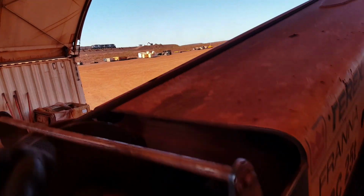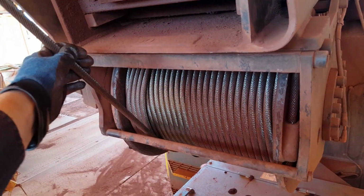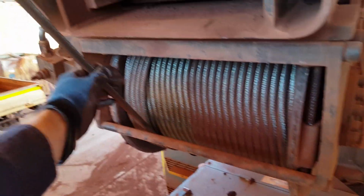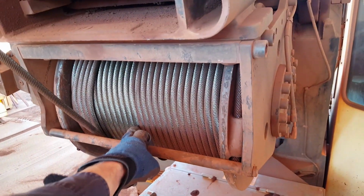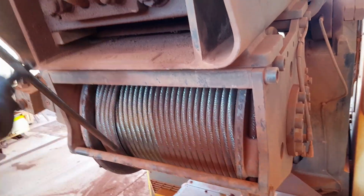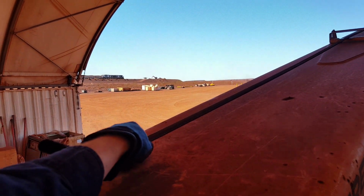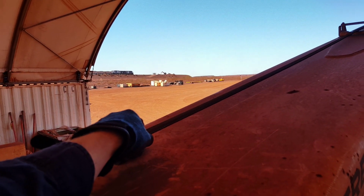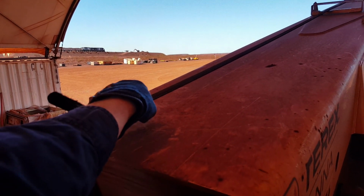There's no weight in here. There's no weight here. And if you're flying on the winch, going up and down really fast, this has got no chance to reeve up because it relies a lot on weight being pulled on it to reeve up in these grooves. And having 6 falls gives you no weight on this. It makes this really sloppy. I'll show you this more extensively in the slew crane because we've actually got 2 hooks in the slew crane to show you a single reeve compared to a 4. Okay.